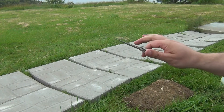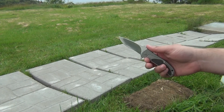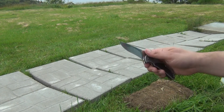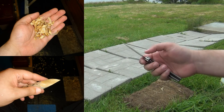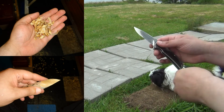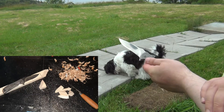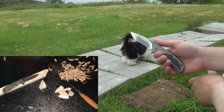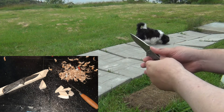In regards to the cutting performance of the knife, it's really high. I compared it to a Mora number 1260 doing some light woodwork cutting. It fell in the same class as the Mora, which you would expect because the edge angles are actually relatively similar. But on deeper cutting, the very strong relief provided by the deep full-height hollow grind dramatically outperforms the Mora — they're not in the same class. Pointing a stick takes four to five cuts with the Mora, and this does it in one — just slices right through it.